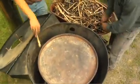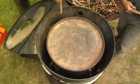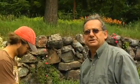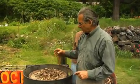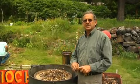The old-fashioned way of doing this — building a big mound, covering it with mud or clay, and restricting the airflow so that it burns very slow at a very low temperature — is just about the worst kind of pollution there is: a lot of long-chain hydrocarbons, tars, ash, carbon soot. It's really a nasty way to make charcoal. When we do it this way, where we separate the fire from the char feedstock, we get a clean, hot flame which reduces all of the volatiles to a little bit of carbon dioxide and a lot of water vapor.